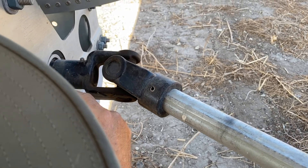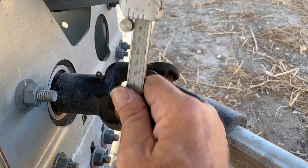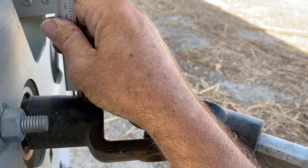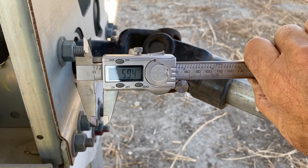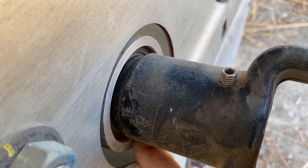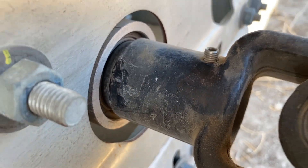What I'm going to do is measure how much of this set screw is sticking out of the u-joint body. I push this down until it stops — this set screw is about 5.94 millimeters. We're also inspecting to see if these u-joints are pushed in far enough and are mating with the little dust seal so there's no air gap. This one looks okay.